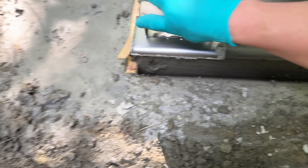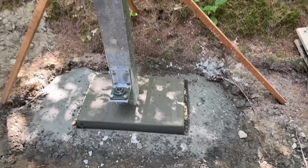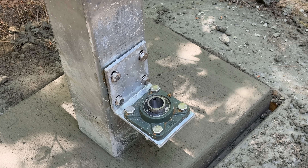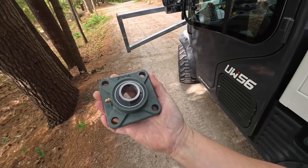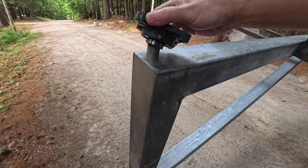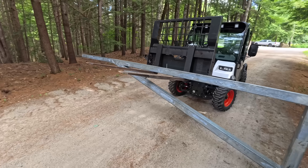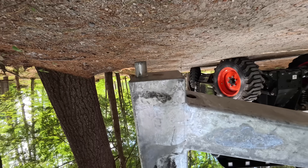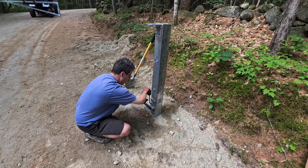Another unusual thing is the way this gate is hinged. Most hinges go on the side of the post, but these hinges are placed on the top and bottom above the gate. Hopefully these bearings will allow it to operate smoothly — they've even got grease fittings, which means maintenance over time should be pretty easy. I let that concrete cure for about a week, which should be plenty of time to reach enough strength so I can place the gate. Before I do, I double-check that the lower hinge is level and everything is secure.